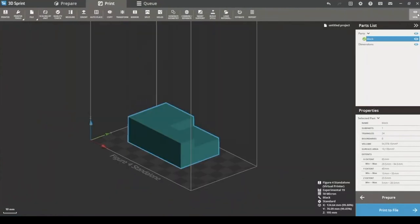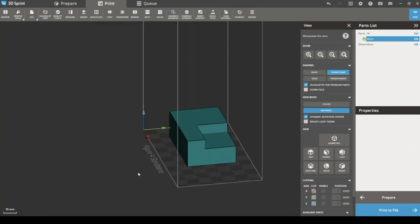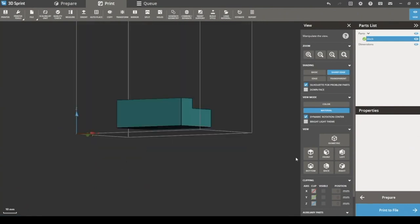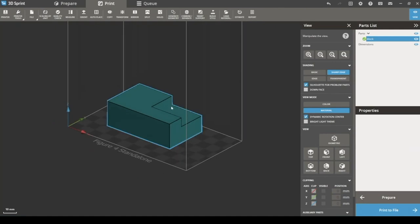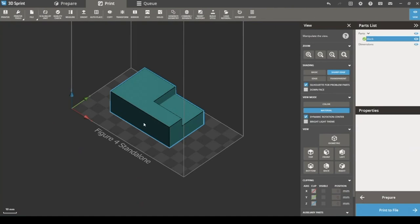And I'll be honest, I've got a long injection mold experience, and I would not injection mold this part because it's going to be full of sink and it's going to have distortion and it's just not going to injection mold well. The only technology that does well in these big blocky parts for me is extrusion and machining. This is just not something for an additive manufacturing solution. So if I were going to try to print this part, I would just say no.